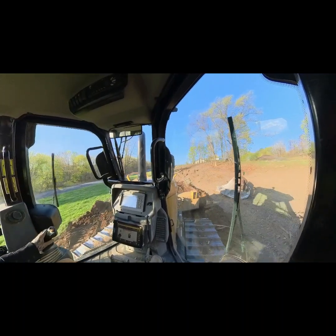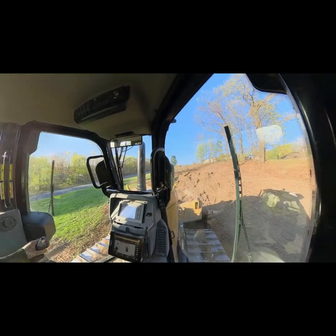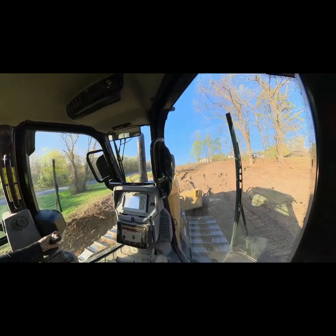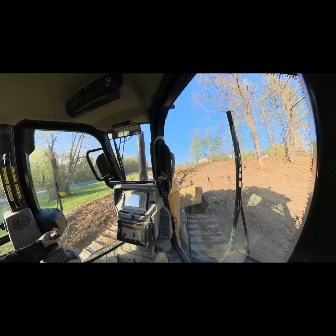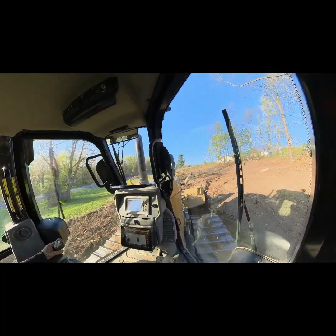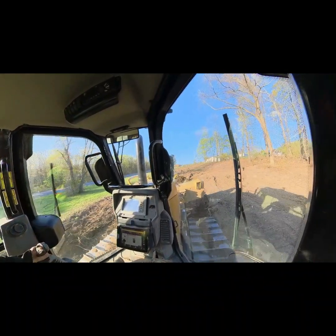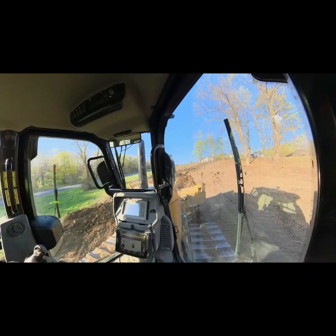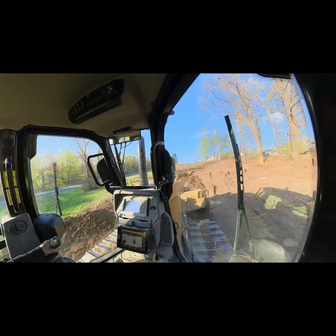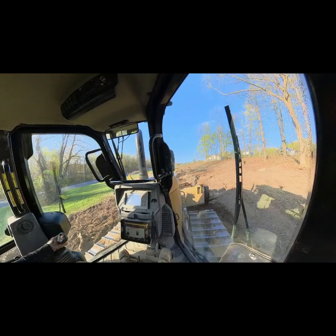We have a lot of highs and lows yet, but at least we're able to travel at a good travel speed without too much impeding. And I've gone ahead and made my way right down through here and I've etched out exactly where my culvert run is gonna be. I'm doing that to give me kind of a reference. Once this main fall is nice and square, true to grade, then you can go ahead and start cutting your edges and working that windrow. So anyways, that's what we're doing. We're gonna keep poking away at this and just trying to get it square. We'll check in a little later.